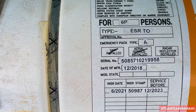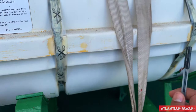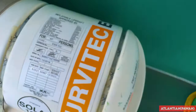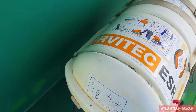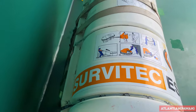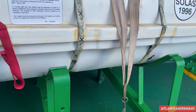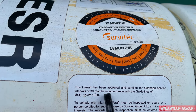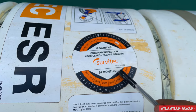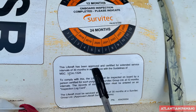Note the serial number from every life raft, as it needs to be filled in the certificate back in the accommodation. Also check: condition of the HRU, the connection of HRU, the lashings on the life raft, the condition of the GRP container for any damages, that the painter is correctly connected, and the HRU expiry date. Once all these checks are confirmed, you can go fill the certificate. Note that within 30 months the life raft must be serviced by a shore station - at 12 and 24 months you do on-board inspection, but by 30 months shore servicing is required.